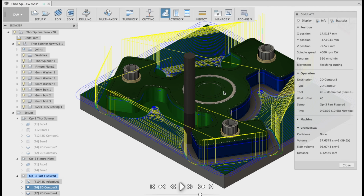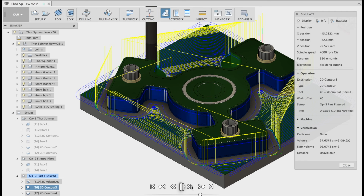In my video, I used half inch plate because that's all I had at home for the video, and I had to surface it quite a lot to get it down to size. So I suggest you guys buy some 10 mil plate, and that way you'll get your 3/8 height, which, you know, 9.525, whatever it is. Okay, so we cut it out with the 2D contour.